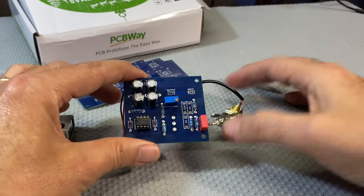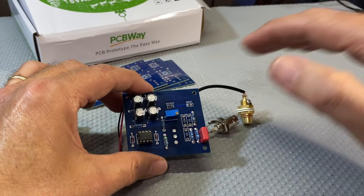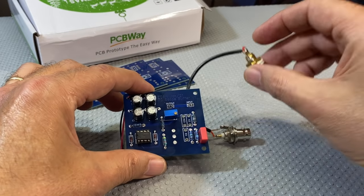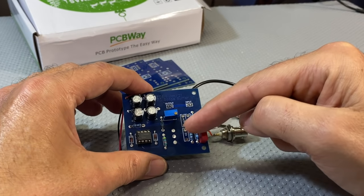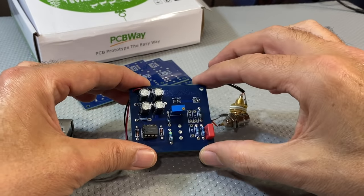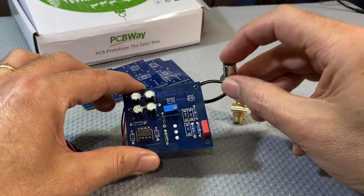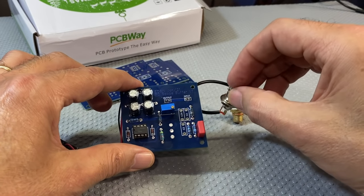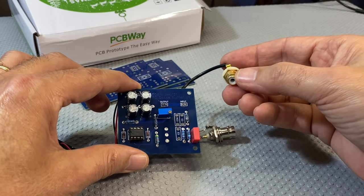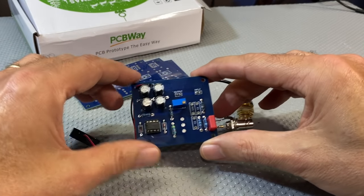So what I'm going to do next is I want to see how flat this is. There's no point trying to do a frequency response plot of your signal coming in here and going out here if this thing is not flat. I also want to see how well the attenuation works, whether it does actually give us 10 to 1. So I'm going to feed a signal from the signal generator into here — direct for now. We'll try an actual scope probe later. And I'll send this signal to the actual real oscilloscope so we can test this board and make sure it works well.